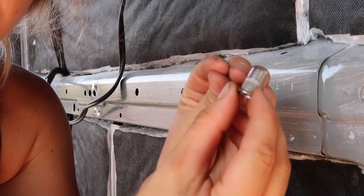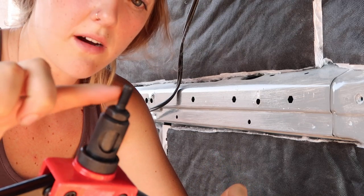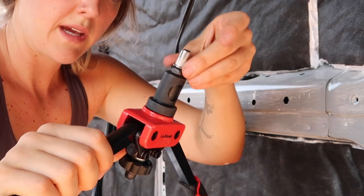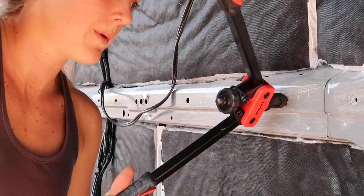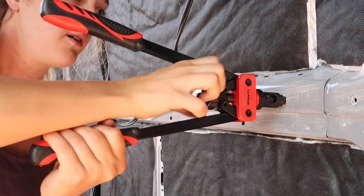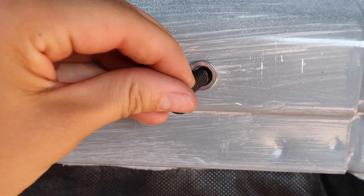The piece that gets crimped down in the back kind of acts like a washer or a nut. I'm going to open it up all the way. This fitting on here is specifically for M8. The tool kit I got has like M3 to M10. You thread it on, making sure to thread it on as the handles are totally out. Then you just put it in the hole and you pull down — you just crimp it together like so. This is the part that's a little harder than I thought it would be. That just crimped it to the back. Now you take this and thread it back out. Now you have a perfect hole that your bolt can thread into. I'm going to finish putting in my riv nuts, then I'm going to drill my holes in my board and thread these through, and that's it — my garage is up.